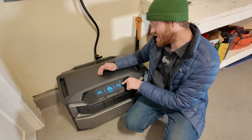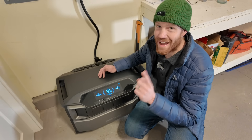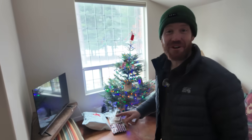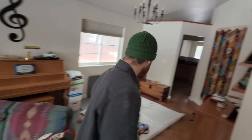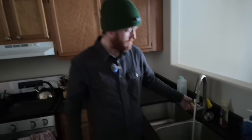Currently this house is using 173 watts, which at this rate means we have an entire day of backup power off just one battery. Let's head inside and see how everything's working. The Christmas tree is still on because it's plugged in where the TV plugs in. Let's test our first critical load, the TV. I felt a little silly setting the TV as one of the critical loads, but a lot of times the power goes out at night during cold, dark weather — and that's probably the time when I want to be watching the TV. It works. Next up, let's check the fridge — it works. Next up, the well pump — still have water.